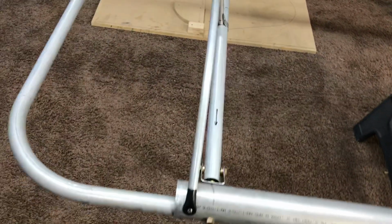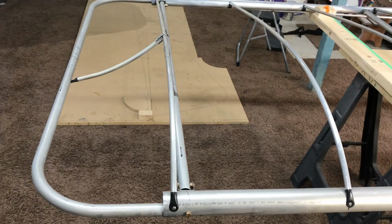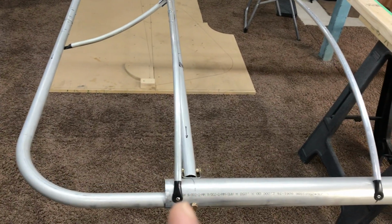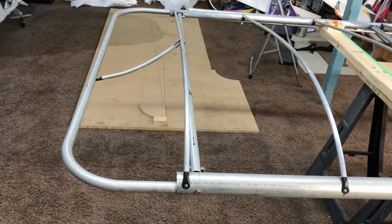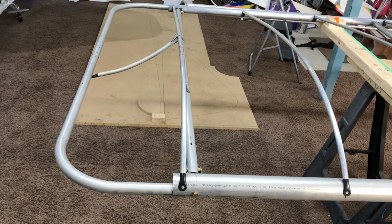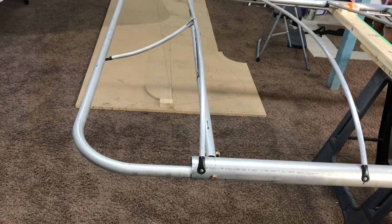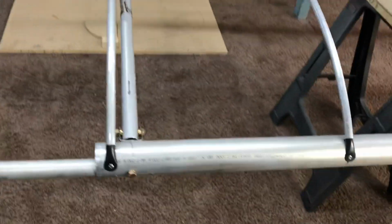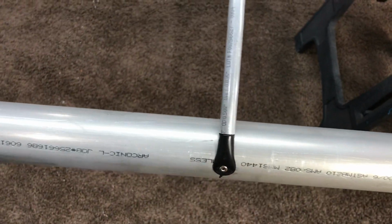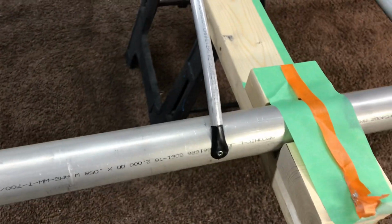So we did that at the end of the wing. Here's what I did to close out the end. Again, a vertical support here and there because the fabric will deform that, and that's my wingtip support. My hangar is only 24 feet long, and the wings have to fold to fit in next to the other plane. So I made each wing 13 feet long, so when the wings fold, they stick off the back of the tail, but from the spinner to the wingtip end is I think like 22.5 feet, so it should fit in the 24-foot hangar. Not too bad. Covering is going to start today. Of course, you take hockey tape and cover off the ends there to make sure the fabric doesn't chafe on those.